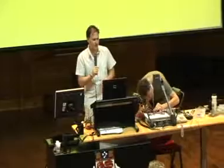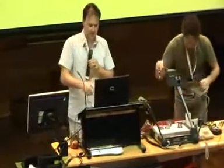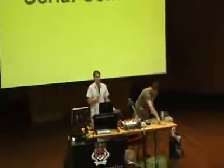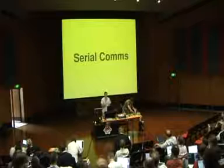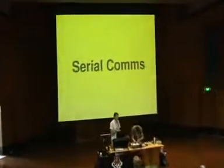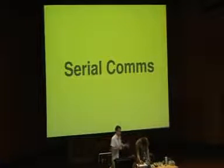What it does is act as a bridge between the serial port and a network socket. You can define a serial port and a socket, and it will link the two together. It allows you to expose a serial port to a network directly. That means that by connecting up an Arduino and then using Ser2net, instead of using the IDE to talk to the serial port, we could be exposing it over the network, which means it's trivial to talk to it from basically any scripting language, because pretty much anything can make a TCP connection. So you could write some code in Perl or Python or Ruby or whatever you want to use, and you simply open a network socket, and you can be talking to the Arduino, which can then be interacting with hardware. So that's an example of a really cool way to bridge the gap between whatever your favourite software environment is and actual physical devices.